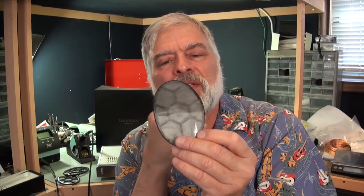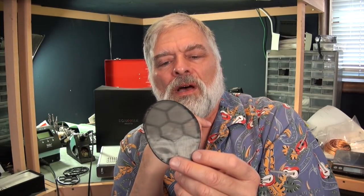At any rate, there are problems with harmonic distortion, particularly second harmonic distortion, with this type of driver. Also, you'll notice that all these individually emitting cells are different sizes and shapes. That is a little unusual for sure, but it has the advantage that you don't have a single resonant frequency driver. You have drivers that have a distribution of resonant frequencies that Sonoma claims kind of evens out the performance of the driver as a whole.